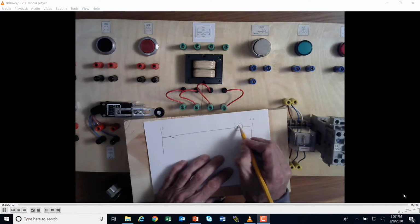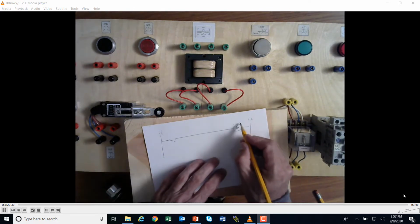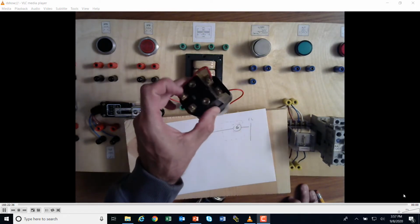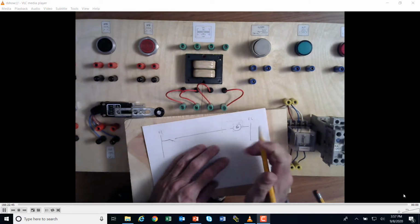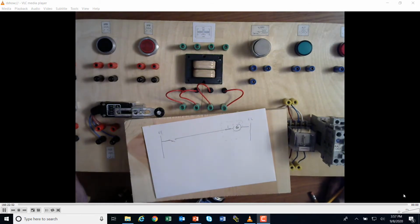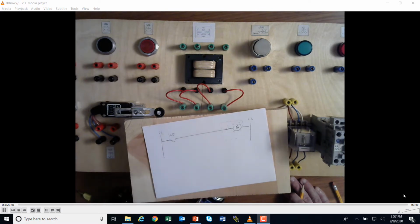But the first thing that we would want to do is check rapidly to see if the green light was on or off, okay? So what we could do is take this switch, and remember, this whole thing is all together. It's all part of one thing. The switches and the coil here are all part of the same thing, okay? So we could wire a normally closed push button contact right there, so that if I hit the 1 LS right here, that would cause that green light to go on, and we'd be all set, right?